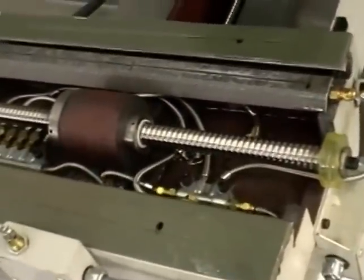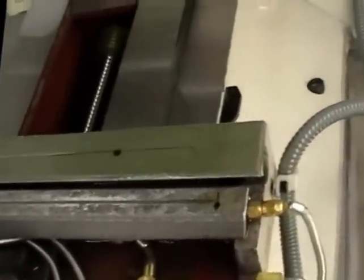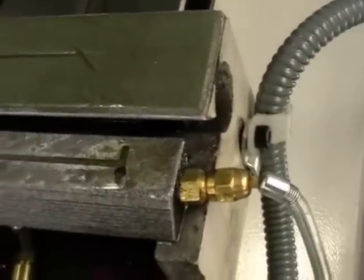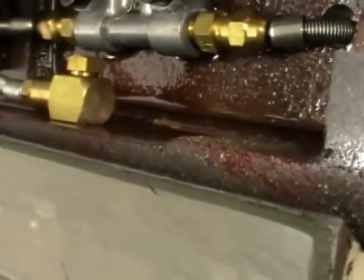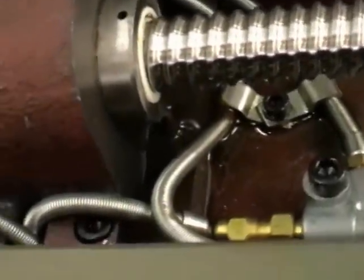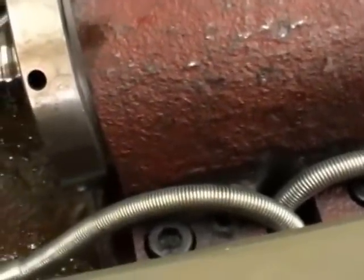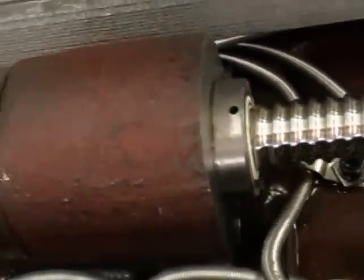This is the underside of the table exposed — the X slideways. You can see the oil; I did a little test with the oil flow and it's coming out of the oil holes as far as I can see. There's none appearing there but you wouldn't expect it to because it's draining out on the underneath dovetail quite well, so it would flow there if that was blocked. So that's the four slides — oil flow is okay. As far as I can see there's oil getting into the ball screw nut as well; it's pretty wet with oil all around it.